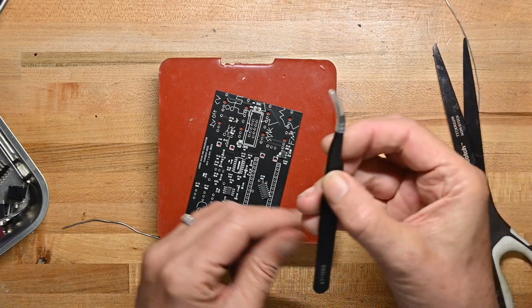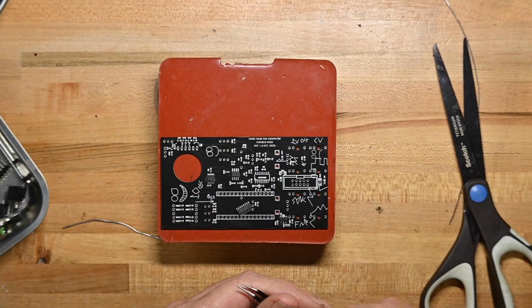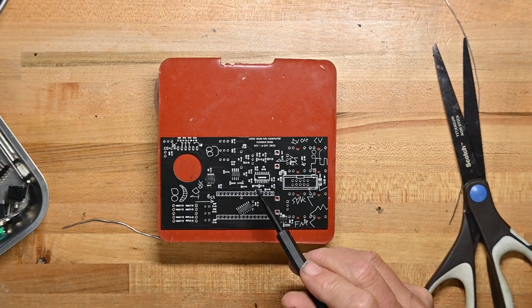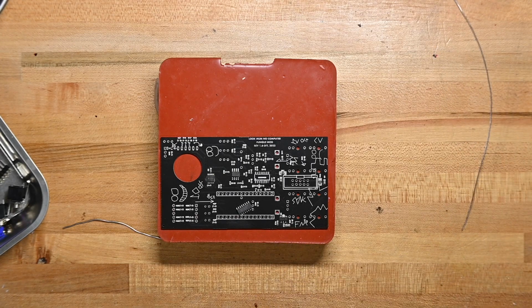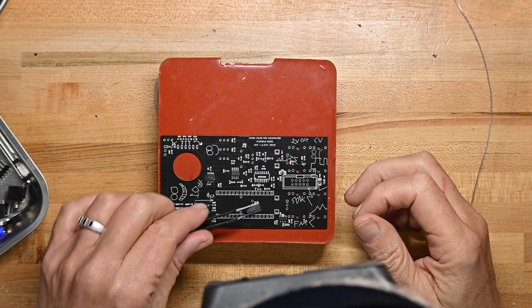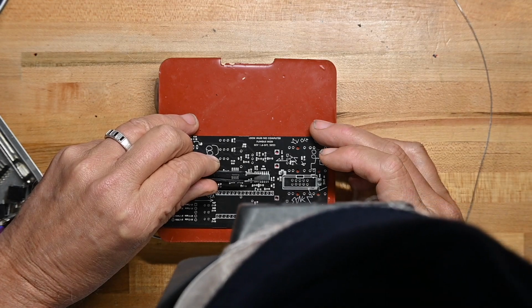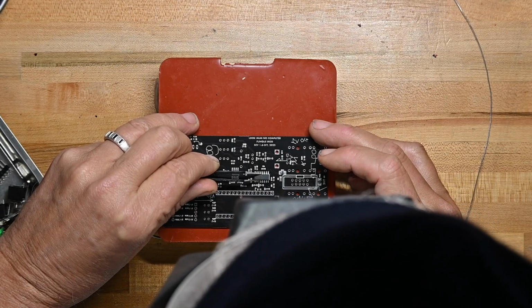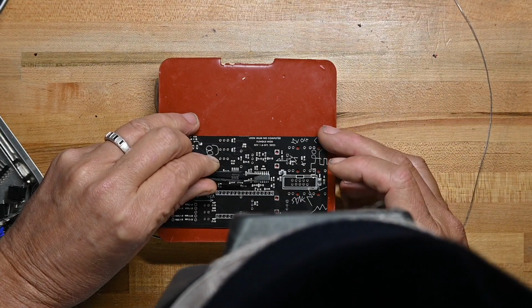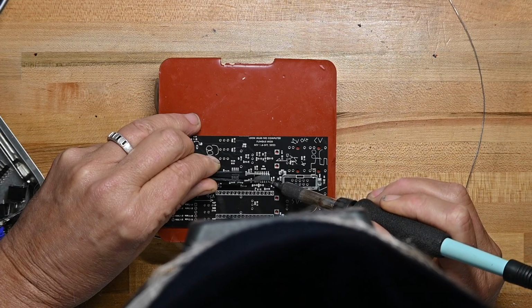Now the next thing you need for good surface mount is a good pair of tweezers. Now you'll see on the circuit board there is a dot and the corresponding dot on the oscillator chip. Hope I don't get my head in the shot too much. I usually do when I'm doing surface mount. So we'll move the chip onto its pads so it's evenly spaced and all the pins are on a pad correctly. Now I'll get my soldering iron and reheat that little solder we had.